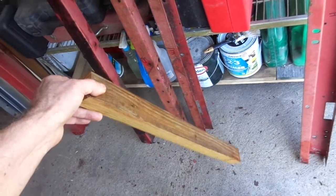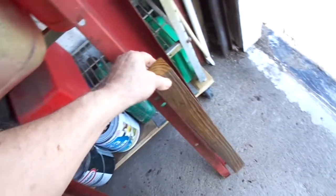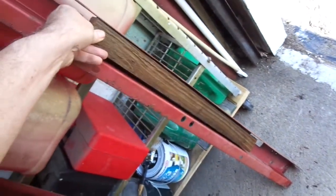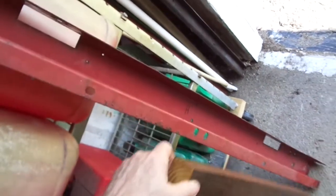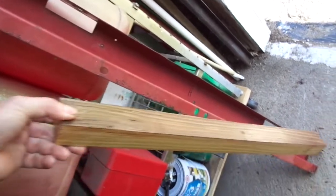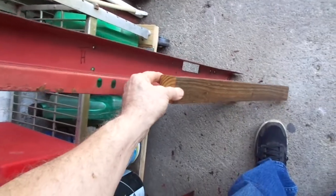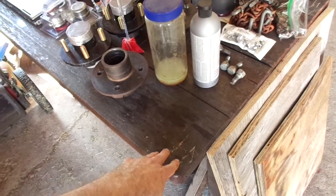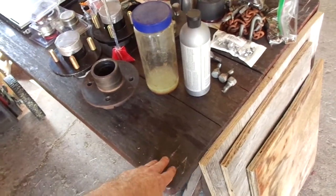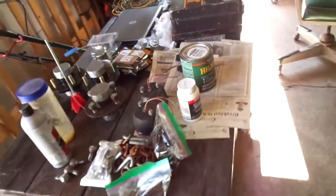I had this treated piece of wood that's been sitting around for over 10 years. The thing has dried out so much it's so hard you couldn't even pound a nail through it without bending it. And besides that, you can see the shine on it — I put several coats of polyurethane on it. I'm just going to take some wood screws; this piece has got tiny holes you can use for mounting the deck from this side, or go from the other side and mount this piece of wood underneath. Since it's a treated piece of wood to start with and I've also put polyurethane on it, it's certainly going to last another 10 years or a lot longer. My workbench is a picnic table that was so dried out after staying outside in the winter — I put three coats of polyurethane on it; the first two coats soaked right into the wood, and finally the third coat stayed on top. It basically turns the wood into a piece of composite wood and plastic.